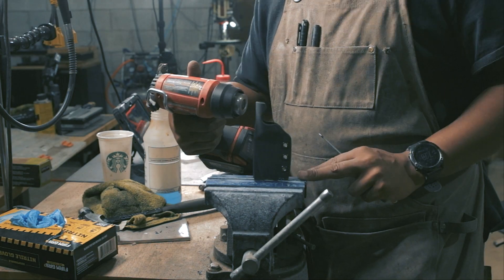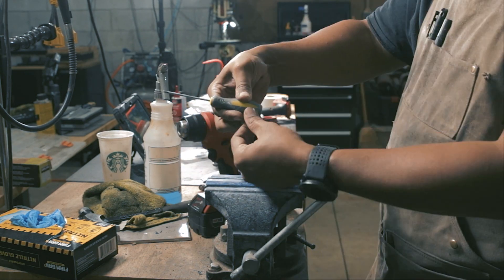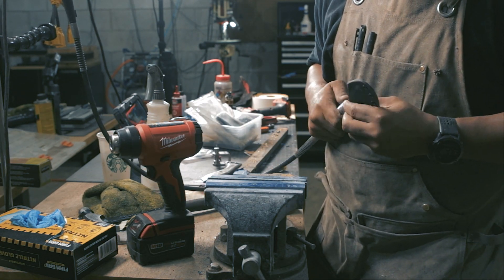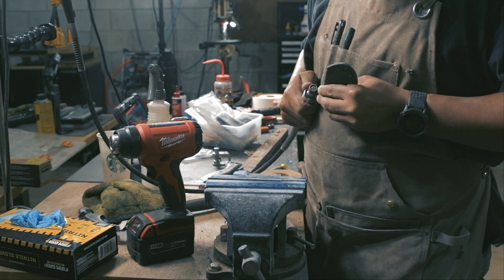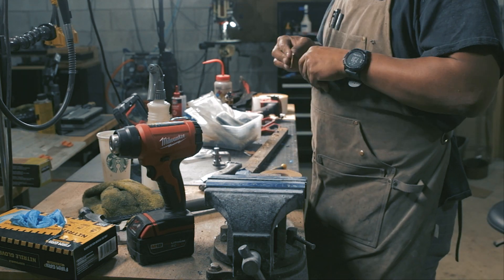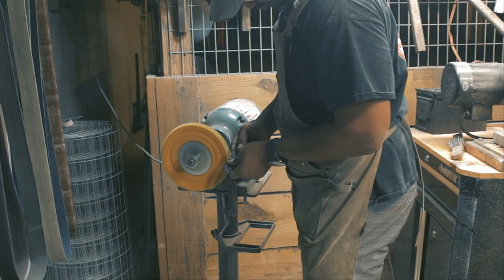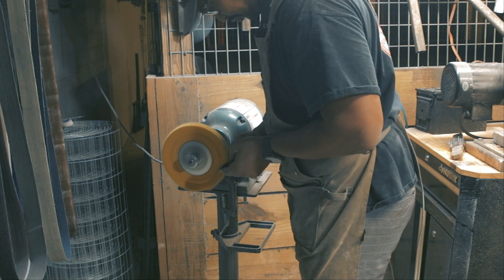Here's the part I forgot about — this is great stuff. A little heat gun and we'll shape up a little thumb push to make it easier to get the blade in and out, give you something to push up against. Back to the Dremel to get that thing to shape. That's why I left that little lip up there — to create that thumb push. It actually works out really well as opposed to having to add something else. Just bend that Kydex around and give it a good buff so those edges look good.